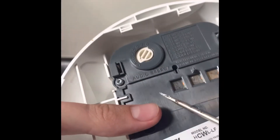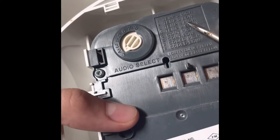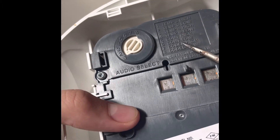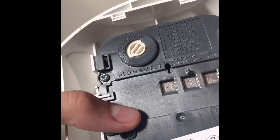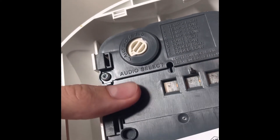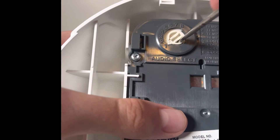Right here is the mounting bracket. This is where your wiring terminals go in — it's two wire — and this is the back of the alarm. Over there is your tone selection. It has a high and low setting, a volume setting, where you can do temporal three, temporal four, continuous, or coded. We're going to be trying all tones set on the default high setting. You can use your terminal screwdriver to change the tones if needed.